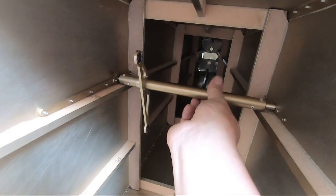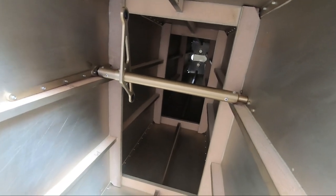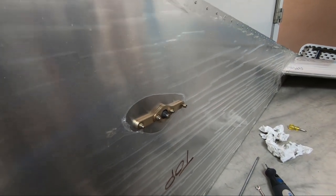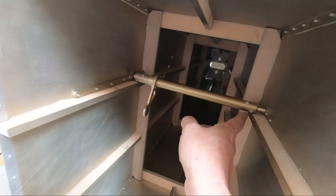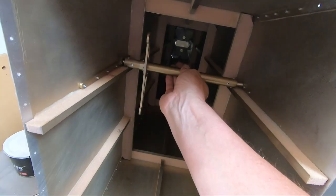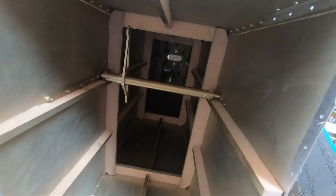Here's the completed bell crank assembly — it fits nicely, I've got the bearings all installed and lubricated, and I've got all the bolts on the outside. I'm missing a number 6 washer somewhere that I've got to replace, but otherwise everything works great. I was able to just trim a little bit along the metal to get the rivets to clear, and trimmed a tiny bit of foam to keep it from rubbing — but now I have no rubbing. It spins nicely. We will start working on the rear bell crank.